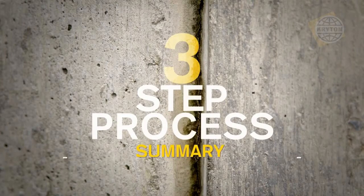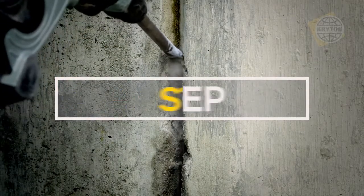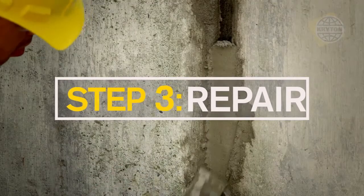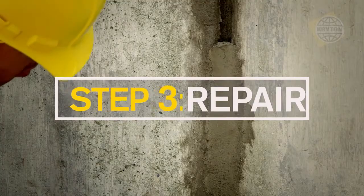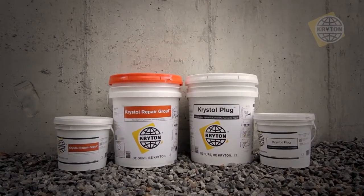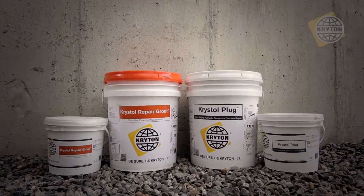Repairing leaks is a simple 3-step process. Just prepare the chase by chiseling into the concrete, stop flowing water with Krystol plug, then fill the chase flush to the surface with Krystol Repair Grout. Through proper installation and following the simple 3-step process, the Krystol Leak Repair System will offer a permanent waterproof repair solution for leaking cracks, joints, and holes.